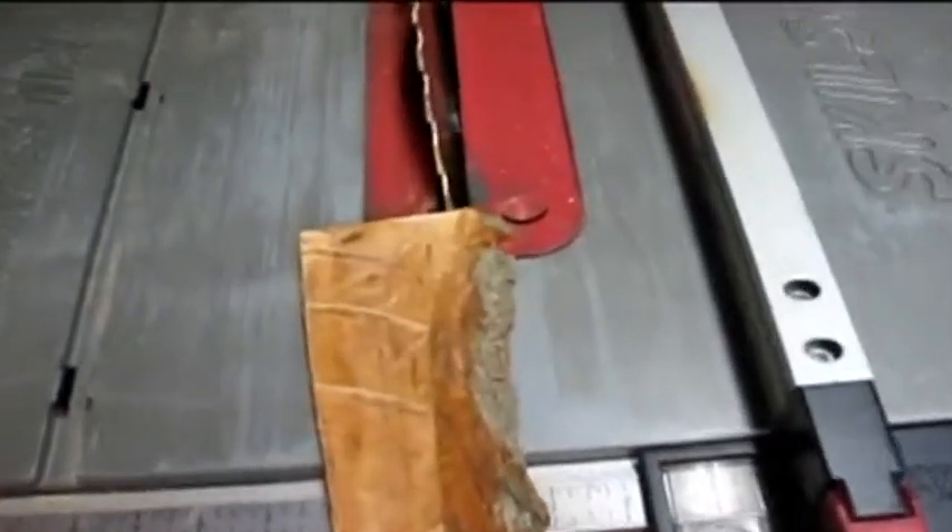See how this limb is — see the bark on it. Then I hold it and run it through the saw and try to stay right on the edge of the cambium, or whatever you call it. You've got to have it measured out to the thickness of your wood, and then you glue it on. Gluing it on these curves is hard because the wood — or the bark — wants to break since it doesn't want to bend. So I heat it up with the blow dryer to help it bend a little bit, then bend it, glue it, nail it, and do that on every edge.